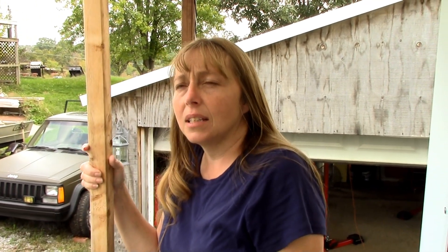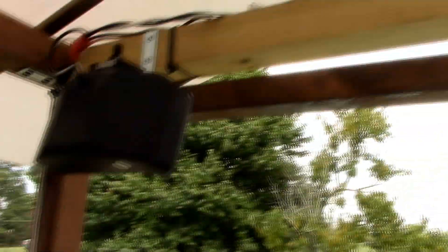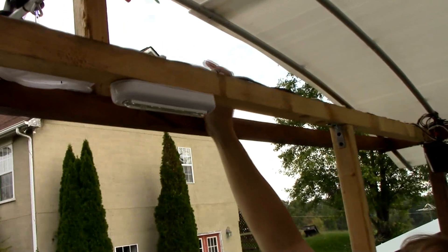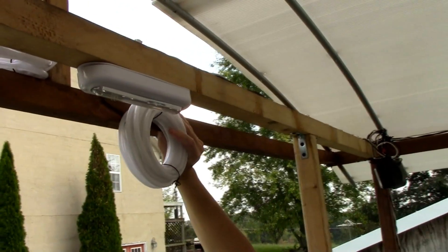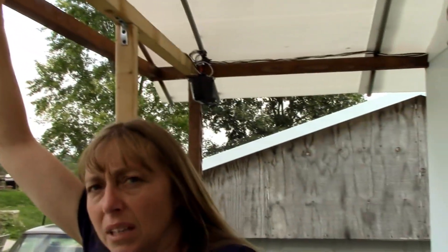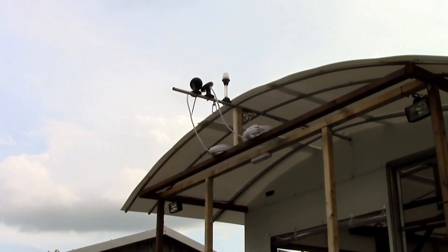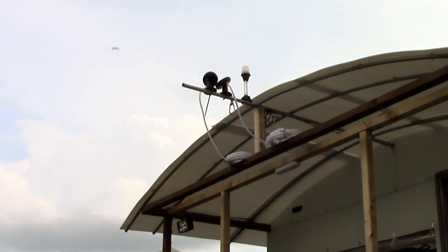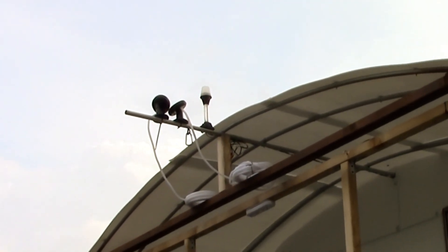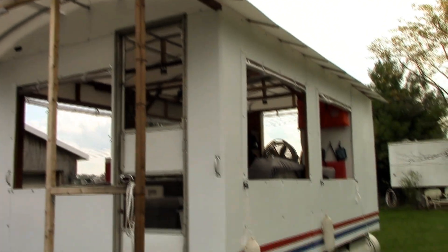We've added more lights to the outside of the boat. We put dock lights up on each side — these were just a set of fog lights. I also have some solar rope lights with their own power supply and rechargeable batteries, and I'm going to run these down both sides of the boat right under the roof just to make us more visible at night. We put another all-around white light on the front of the boat, and there's one on the back. We can control them individually because we really don't want to get hit on the lake at night.